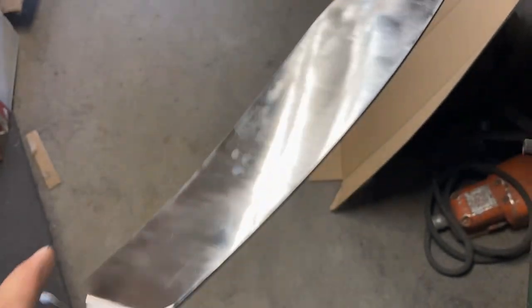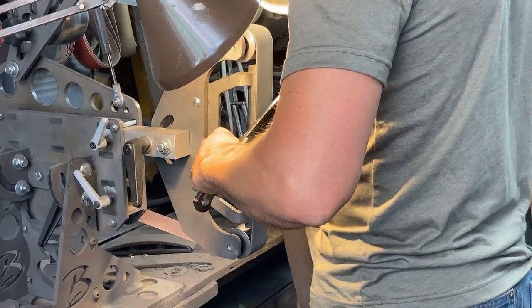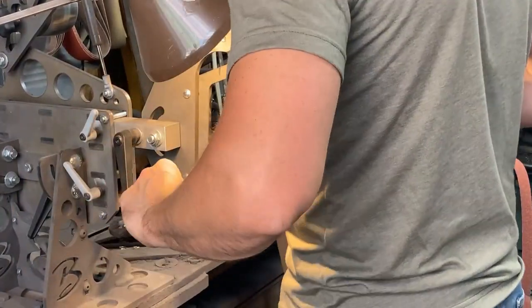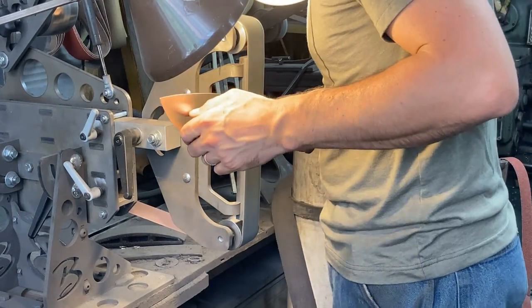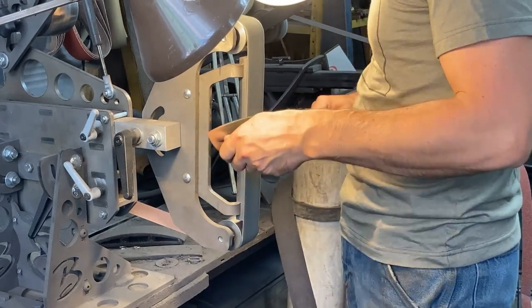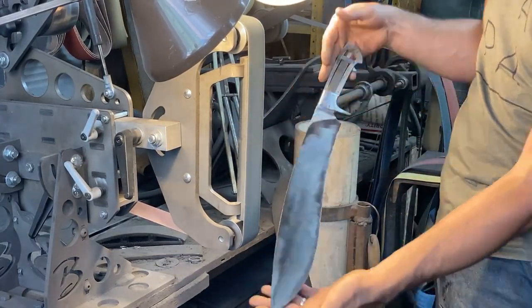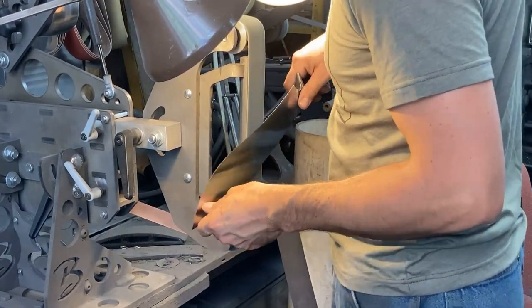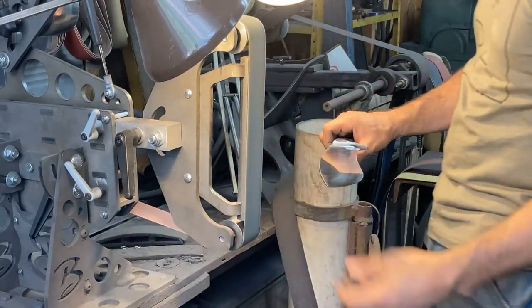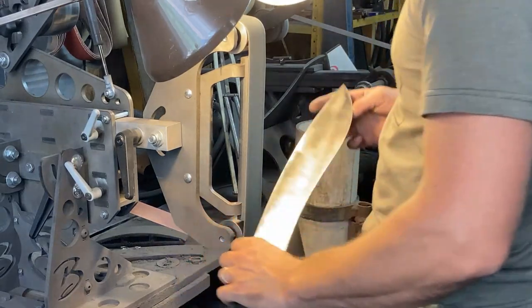Now I'm gonna move this 400 grit finish with some Gator grit belts all the way down to the tip, and then we're gonna be hand sanding pretty soon on this. I've probably put it this way before on some video, but when I'm working with the Gator A45 belt, I like to think about future me and present me. And I try to be a good present me and not create more work for future me and make future me hate past me for doing slipshod work and being impatient at the grinder and leaving scratches for me to hand sand out. That's looking ready for the next step, I do believe.